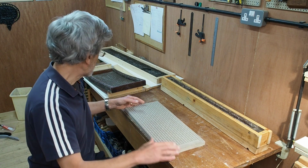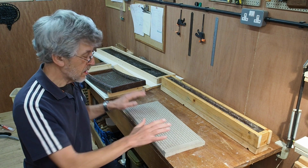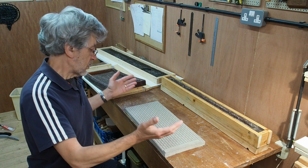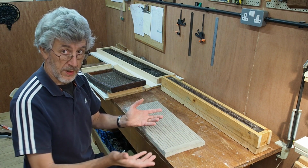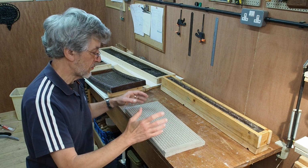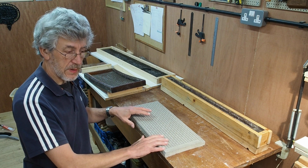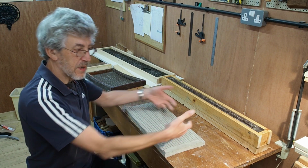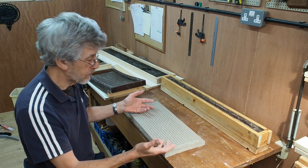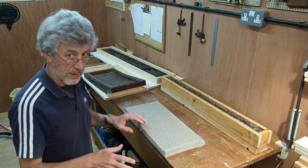With this one, again, the master was semi-destructive. The way that the rubber can get underneath every little nook and cranny is very good from the point of view of producing a nice sharp model, but it's quite destructive if it gets inside any part of your master. Because when you take the bulk of the master up, it will be leaving bits in there, and that's what happened with this one.